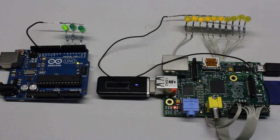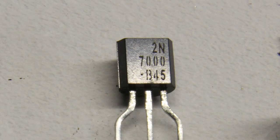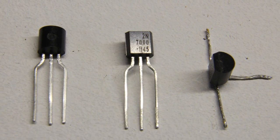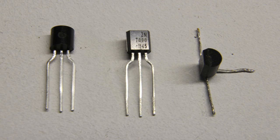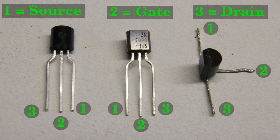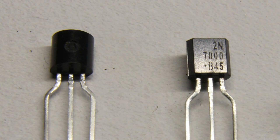So next we will learn how to amplify the electric power using transistors. Basically, there are two types of transistors: bipolar junction transistors and field effect transistors. I would like to demonstrate the use of field effect types, since there is no current needed to control those devices, which simplifies the calculation of an amplifying stage. A field effect transistor has three pins named source, gate and drain. Have a look at the datasheet of your transistor to find out what pin belongs to what functionality. For the first circuits I am using an N-channel MOSFET type 2N7000.